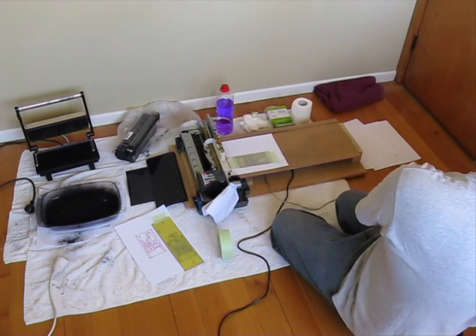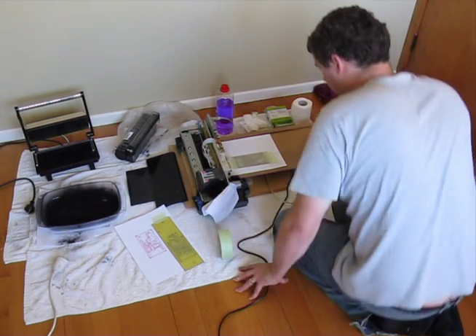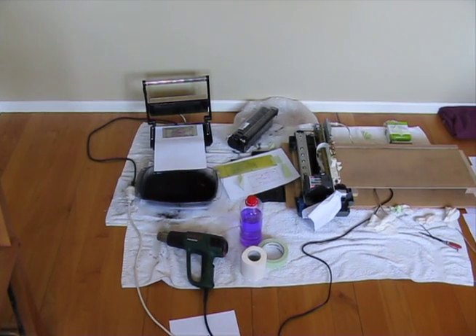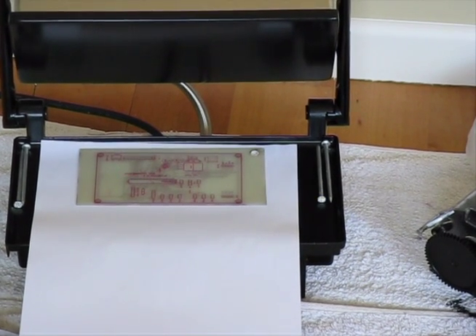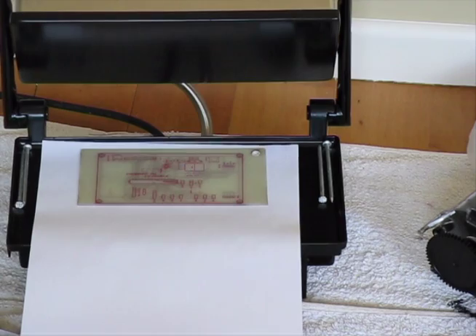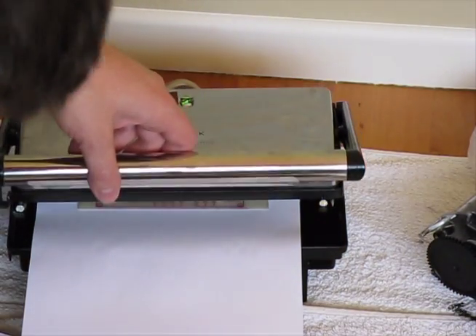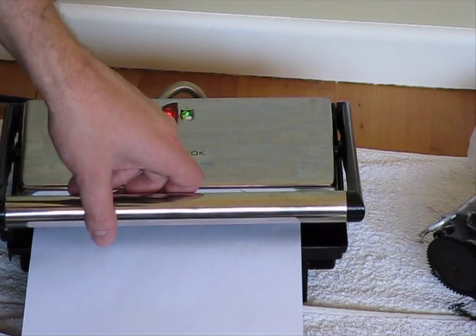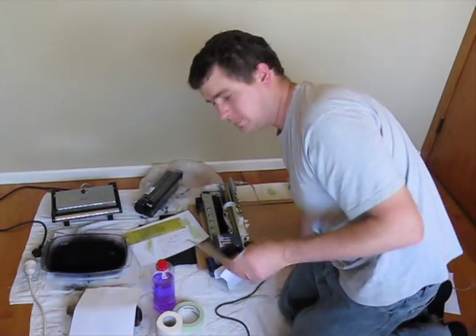This is attempt one. After about five attempts I've finally got the silk screen to line up. I'm now baking it again in the toasty machine to bake the ink onto the board. Once this is done the ink will be really durable on the board and we'll have a lot of nice labels. Here we have it — one printed circuit board with a silk screen.